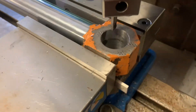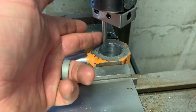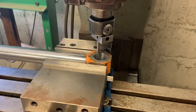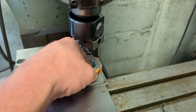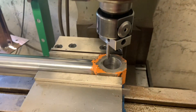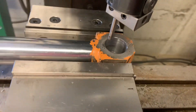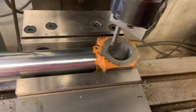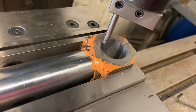It is so close to cleaning up. This boring bar should be a lot bigger but I haven't done a lot of boring so my tooling is pretty limited. This isn't going to be a bearing surface — it's just going to be a surface where the bushing pushes in, so I'm not real worried about it. I'll probably take a little hone or some sandpaper to give it a smoother finish, but I think I'm going to go another ten thousandths — probably take another twenty from the looks of it.